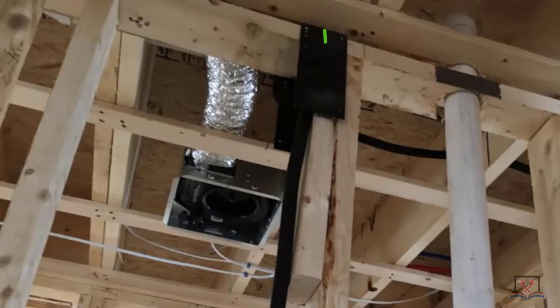Notice it's longer — definitely longer than any of the other ones you've seen. Because of that, all kinds of different moldings that can go on the wall can actually come down well below where the connection or pipe is running through the top plate of the stud. So you've got to be careful — always three to four inches, whether it's off the floor or down from the ceiling with those striker plates.